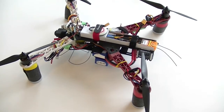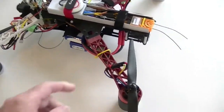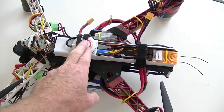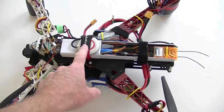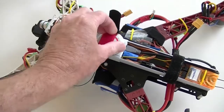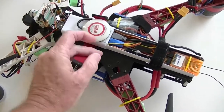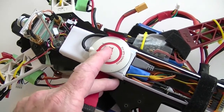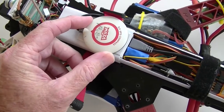I not only turned the compass 8 degrees to the left, but I also moved the GPS compass module. It used to be down on the arm on a pedestal — I took it off that pedestal and moved it over the center of gravity, between all the motors. That's a nice spot for it; it seems to work much better there and still picks up plenty of GPS satellites. It's velcro'd down so I can peel it off and move it if needed, and I've got written on it 'minus 8 degrees.' With my eyesight, if I can get it near minus 8 degrees I think it'll do pretty good.